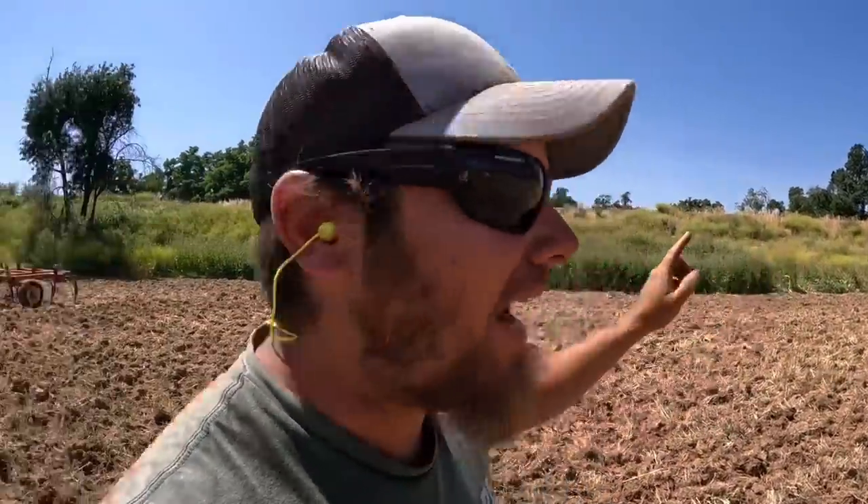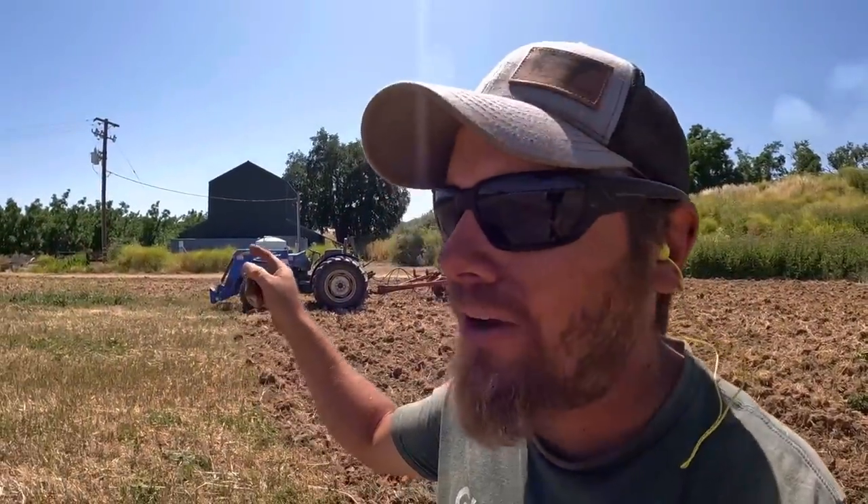We're getting just about done here. I'm doing three passes around the entire field, and I think that chisel is like 12 feet wide or something like that. But down here along the levee and over where the houses are, I'm going to do a few extra passes. The reason for that is that in the past when we did have a fire, it came from on the levee over here. So I feel like the highest potential for a fire source would be the levee, the road, or possibly this transformer here on this tower, so I do a little bit of extra fire break in these areas just to give myself some extra insurance.